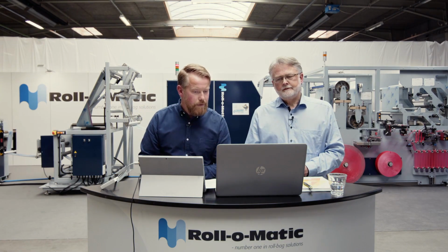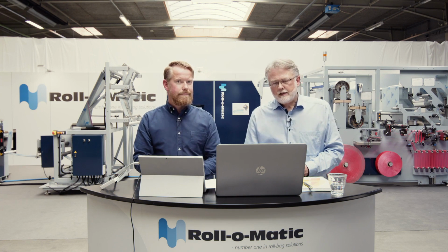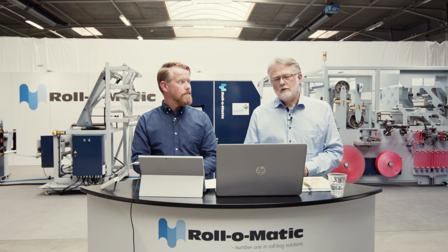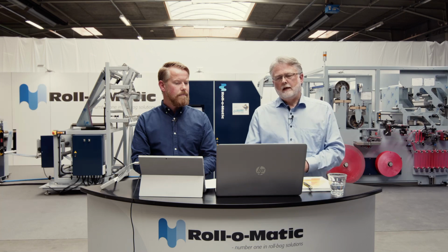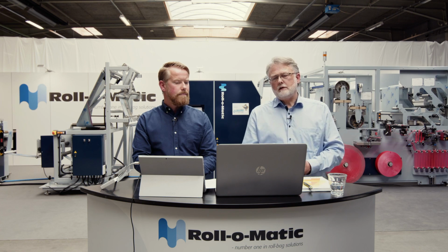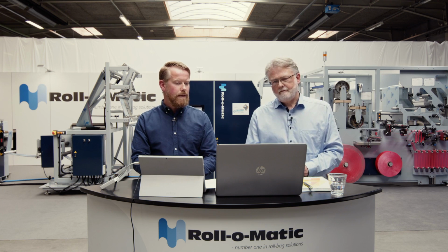Then another question here. I noticed a kind of roll kickout system on the winder. Is that correct? Yeah, it is. It is a quality check that would kick out rolls that are done before the machine goes into automatic, or if a roll loses a bag, then the machine would register that and kick out the roll. And this is mostly for automated packaging, so you don't pack any product that is not up to the standard it should be. So an extra kind of quality control.